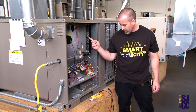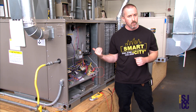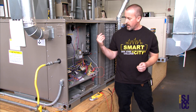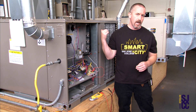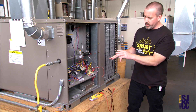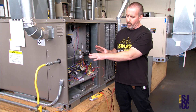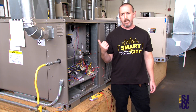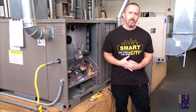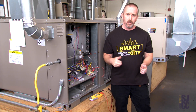Now that I've put the tube back on, the pressure switch is going to reclose and the furnace is firing right back up. You heard the igniter, there's the main burner, and the blower never shut off because the furnace was still hot. So this is a basic sequence of operation on a gas furnace. The next one we're going to look at is a split system furnace, and we're going to look at temperature rise and flame rectification — so tune in to the next video.